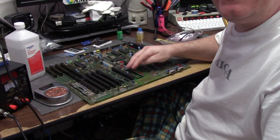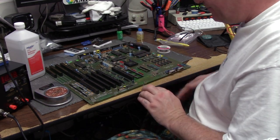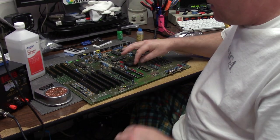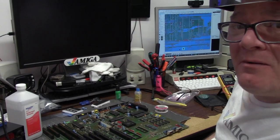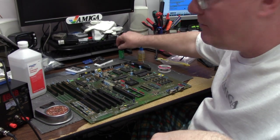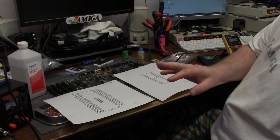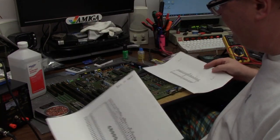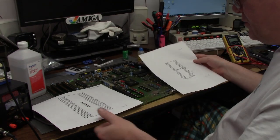This is starting to look more like an actual Amiga now with a CPU socket and a ROM. I'm going to do the continuity tracing — print myself out two sheets, one for the ROM and one for the CPU. That way I can write down which pins I need to fix, then flip it upside down, put it in Sprint Layout Viewer on the bottom view, and start wire-modding things that don't connect. It's currently 3:25 PM. I did take a break to go get the old green nail polish and a chocolate bar. I have a pinout of the 68000 and the ROM, and I kind of write on there the direction of the chip so I know front or back of board.